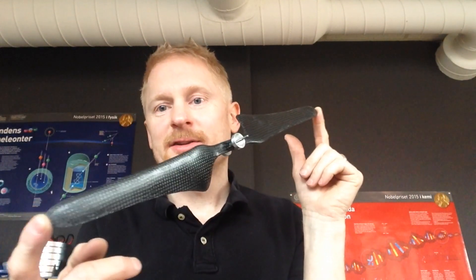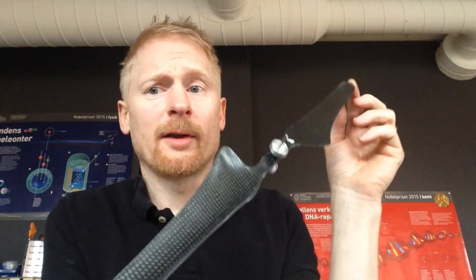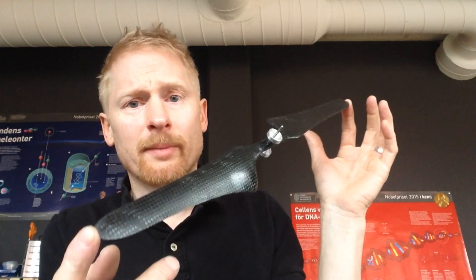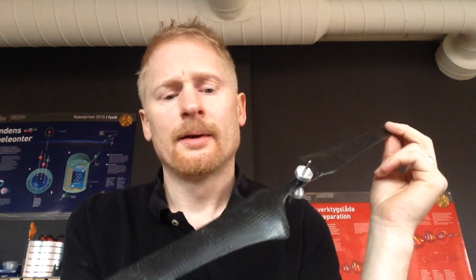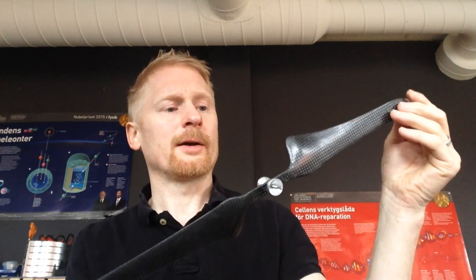And finally, to the delicate matter of balancing your propellers. These are the Hobbyking DJI style propellers, 17x5. They are lightweight — I think they are about 24 grams each — and they have good performance. In retrospect, I would have bought the Hobbyking Quantum 17x5.5. They are well balanced out of the box and only slightly heavier than these. But the first tests I did showed these were a slightly better match with a slight advantage in performance, so I opted for these.